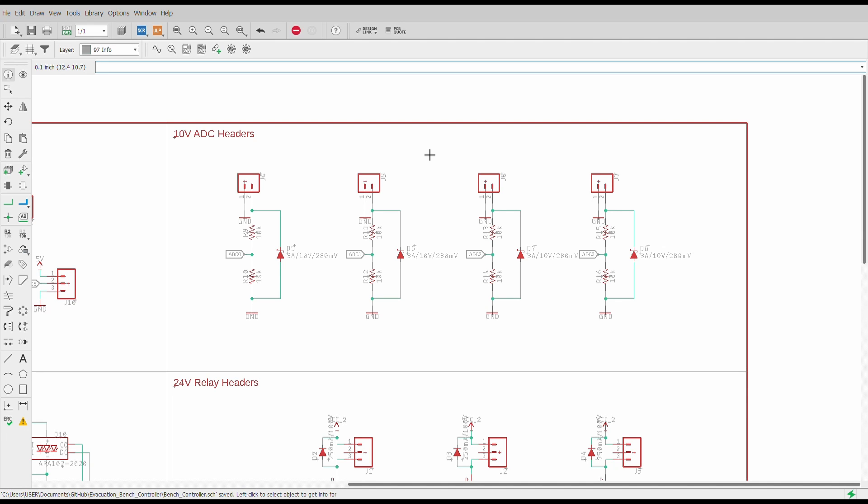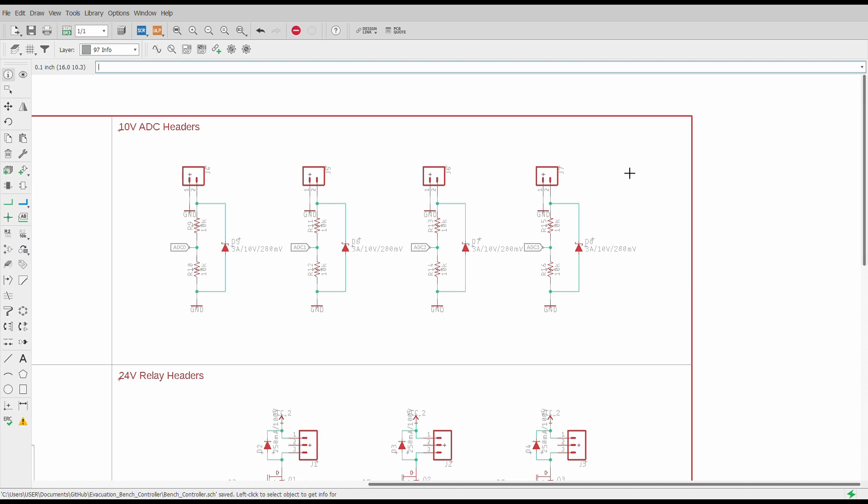Because the Arduino Pro is a 5V system, I did need to rescale all of the ADC inputs to make sure they would be tolerant of signals up to 10V. To do this, I put each ADC on a 1-to-1 voltage divider, and then added a reverse-biased Schottky diode to ensure that the voltage on the top of the voltage divider could never get above 10V, which means the controller should only ever see 5V maximum. This covers all three analog signals from the vacuum gauges, as well as the analog speed signal from the turbo molecular pump.